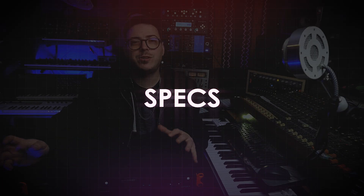Let's check out the technical specifications of both Arturia AudioFuse X8 units. They don't offer that many features — it's quite basic but very functional. Looking at the IN module, it has eight line inputs. This is designed for someone who has a studio with lots of synthesizers, drum machines, or outboard gear and wants to use a lunchbox with external preamps, using this purely as a converter. One potential con is that it doesn't offer mic pres, but if you want mic pres there's another version called the 8 Pre.